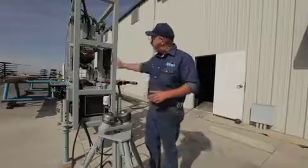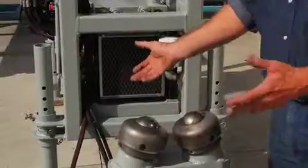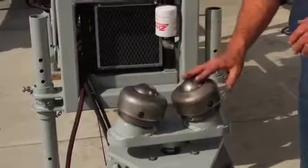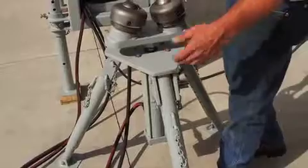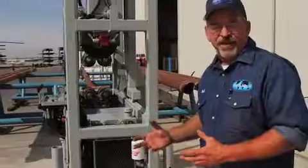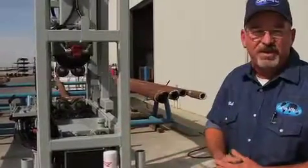In its present configuration, everything is designed to be operated that way. You can see that we have enough jack hose on here to be able to extend our jacks out. We have 750 pound ball transfer rollers on top, 13 inch stroke pinnable adjustable jack legs. So whatever combination we run into with the variation of various leases we have to work on, or working in a yard, the machine is able to handle all of that.